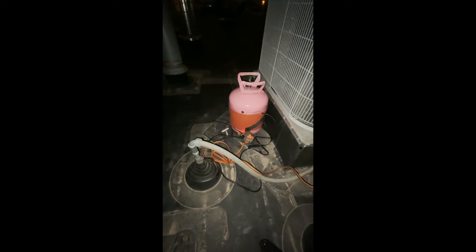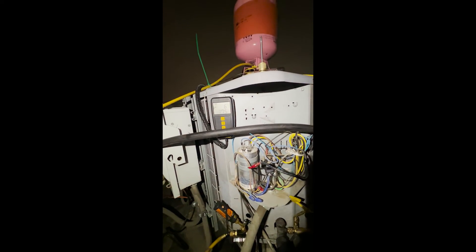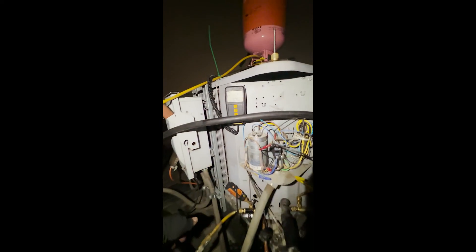That's how we do it in Colorado. While we're pulling the vacuum, we get that tank heating up. Tank heater - definitely key when working in cold, sub-zero conditions. And even when bubbles aren't doing it, break out the ultrasonic leak detector to confirm there are no new leaks. We're charging by lineset length. It's cold out here, so our tank heater has our tank preheated. Our total charge is gonna be nine pounds, eight ounces. It's gonna happen fast, thanks to our tank heater.